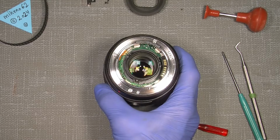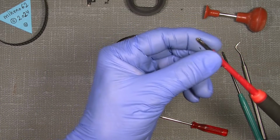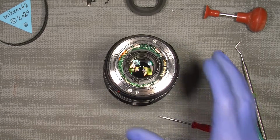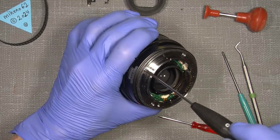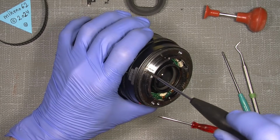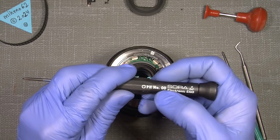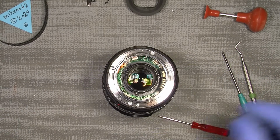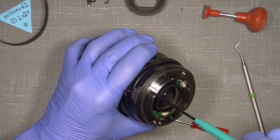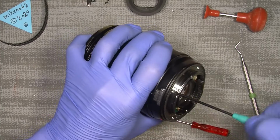And maybe it's not the best screwdriver for that, but if we take another one, could be this one. Well, you see it slips, and this is actually a PH00. It doesn't really work, but if I use my JIS, it will sit in the screw head. Just to make that clear.